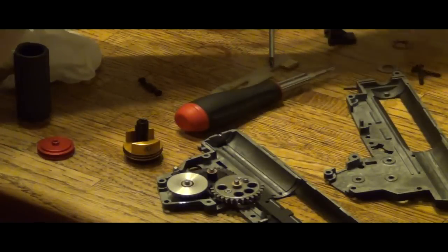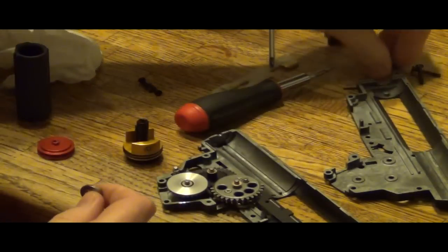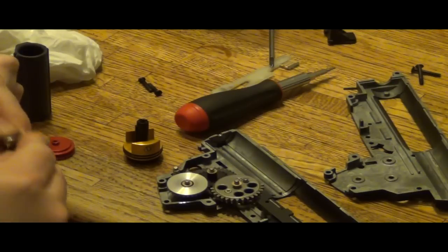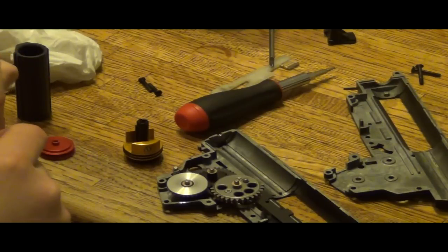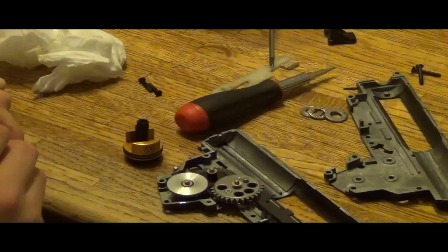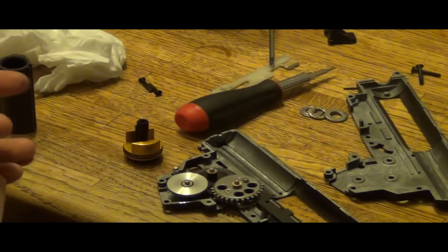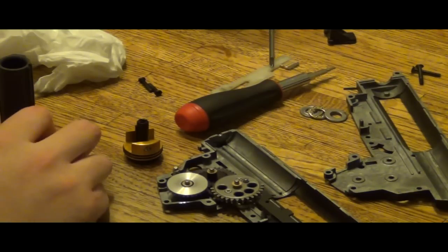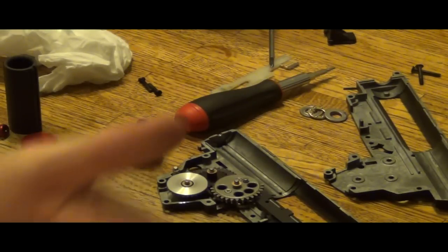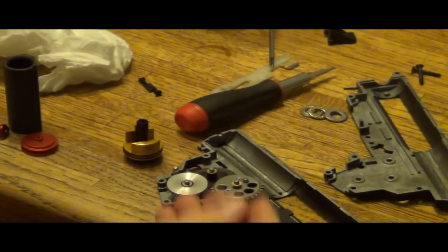Now without these washers, and the bearings, what I want to do is check the inside too. So I'm preventing more possible breaking. What I'm doing is checking how much slippage there is. Okay. And it doesn't look like there's going to be any. So it's all good. Alright, and last I'm going to do is add the tiniest bit of red Loctite. In comparison, this one's nicer. It's got too much oil on this one. It's got some of that gear grease probably on it.